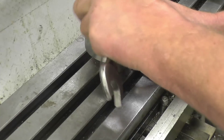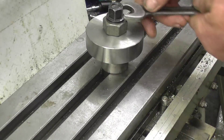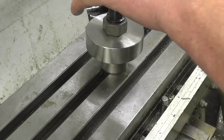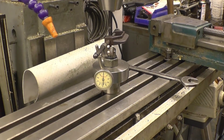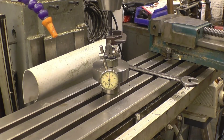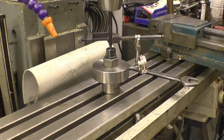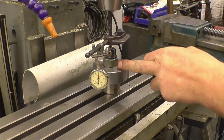I'll find the centre of the bolt hole pattern, which is about there. Then we'll need to centre underneath the spindle — start off in the middle and work from there. This is the centre-finding tool I've used to get it in the middle, using a back plunger gauge, which is a lovely little gauge to use. It's the one Bob made for us. That gauge reads zero all the way around, so I'm quite happy that the spindle is dead in the centre.